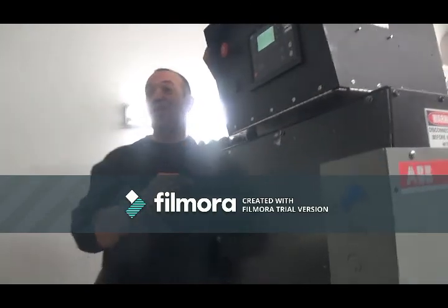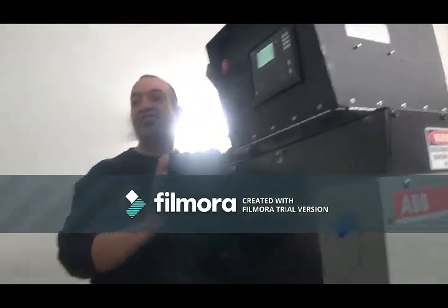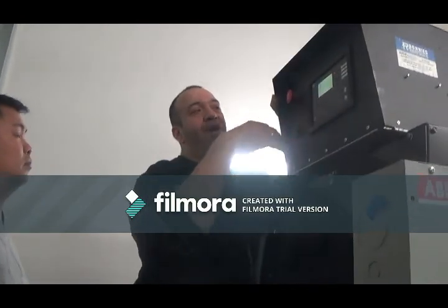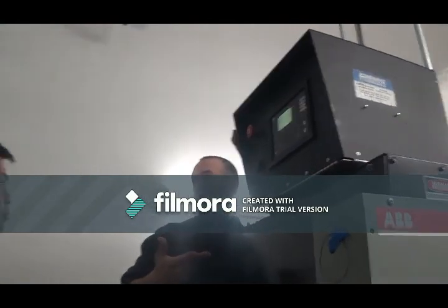Great, 60 hertz. All generators need to be running around 1800 RPMs. It could be off by 1 or 2 RPMs, up or down, but give or take, it's all 1800. So 1800 RPMs will get you 60 hertz. Depending on how they have it set up inside the controller, you might either get 1800 RPMs or 60 hertz. Some controllers might have both.